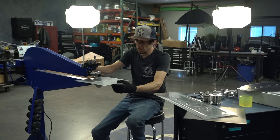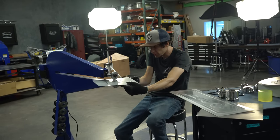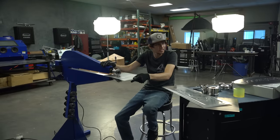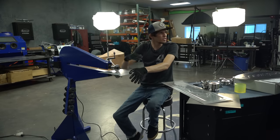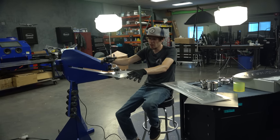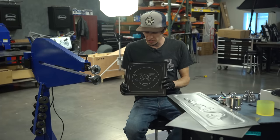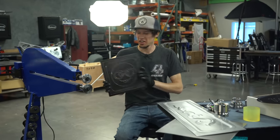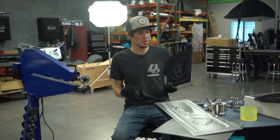If you just do it a couple of times, what's nice about the second, third, fourth, fifth pass is you already have that original line established — it's nice to follow. The top die almost kind of falls in. That first lap around, maybe go a little extra slow and get all those spots nice. I made a few of these, scribed them out on my plasma table at home — I'm kind of the nerdy fabricator, it's the little icon I use on Instagram and everything.